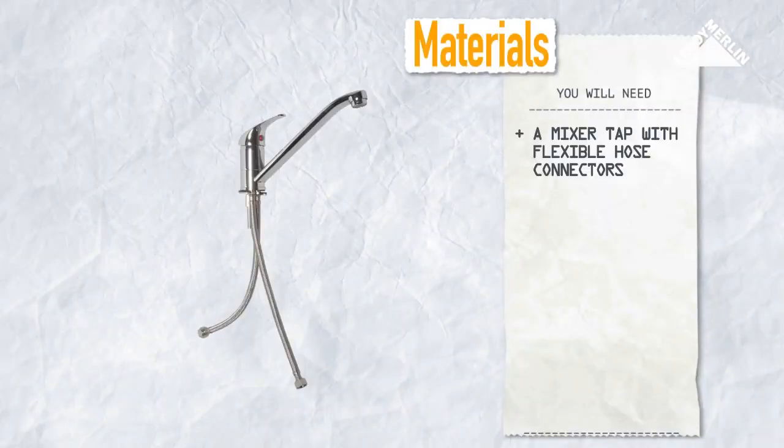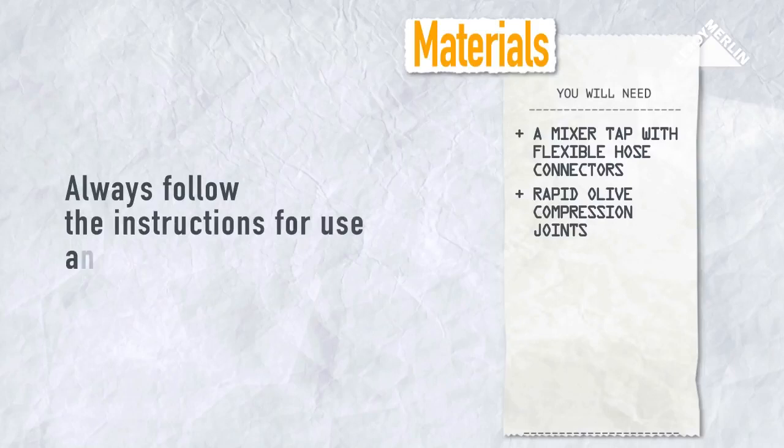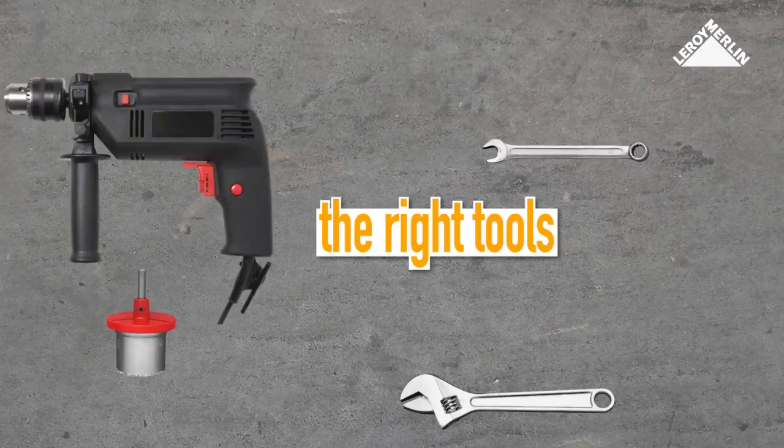You need a mixer tap with flexible hose connectors and 2 rapid olive compression joints. You will need a spanner, an adjustable spanner, and if you need to drill holes for the tap, you will need a drill and a 35mm hole cutter.